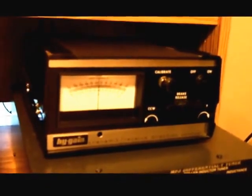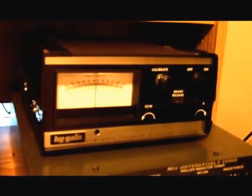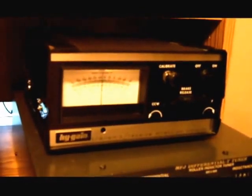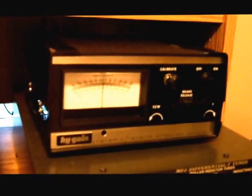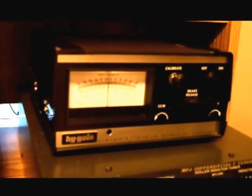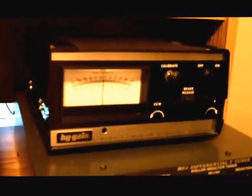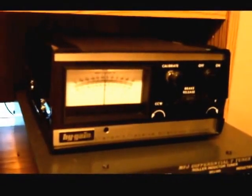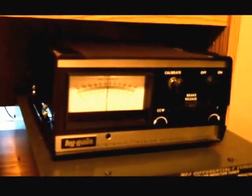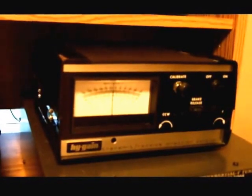They do make a neat board that puts a delay on the brake — it's about $29 or $30 and you can wire it into this box. When you release the brake it waits three or four seconds before actually releasing, protecting the rotor from damage in case you make a mistake and release too quickly. I also wired up a pigtail and a Jones plug on the back of this box so I can disconnect it during a lightning storm and get a little protection here in the shack.